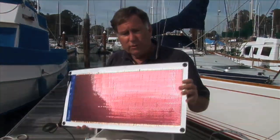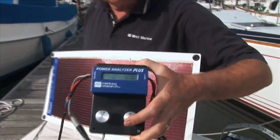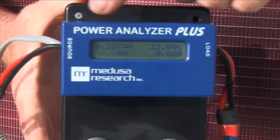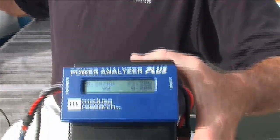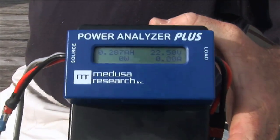To optimize the power you generate from your solar panels, there are a few simple rules to keep in mind. First, the panel should be as perpendicular to the incoming sun's rays as possible. We've got a flexible solar panel — in this case a 450 milliamp solar panel — and a special amp hour meter box that reads out in watts, total watt hours charged back into a battery, amps, and volts, all on one compact display. Right now we're going to get direct sunlight on the panel and take a look at the voltage. It should be around 22.5 volts. That seems like a lot, but that's because there's no load on the panel — there's no battery in the circuit.